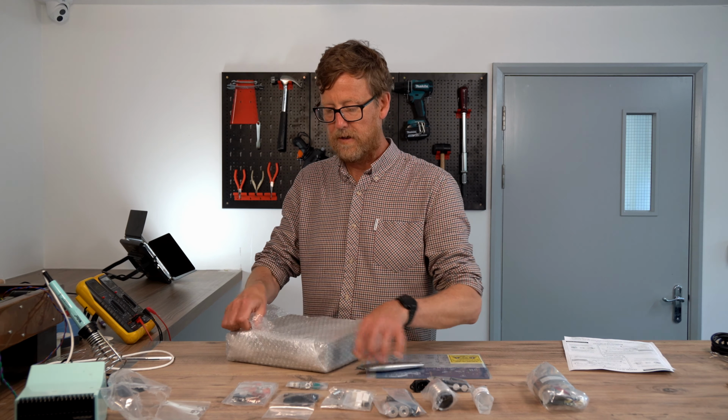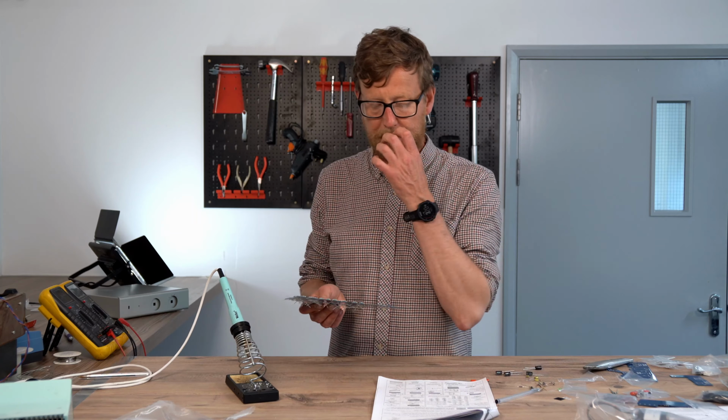So now I'm going to put the resistors in and I'll be back with you in a short while. We've populated the board now of all the resistors. You can see them all here. You can see all the resistors are flush to the board. There's no need to have them on legs. It's not a great idea. And then you've got a bit of a spider's web there. We'll get these soldered now, but I'm quite happy with those. Just go through carefully when you're doing it. You'll see that I've ticked off all the ones I've done. You don't want to get them wrong.